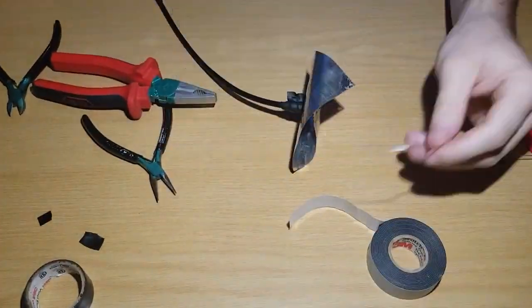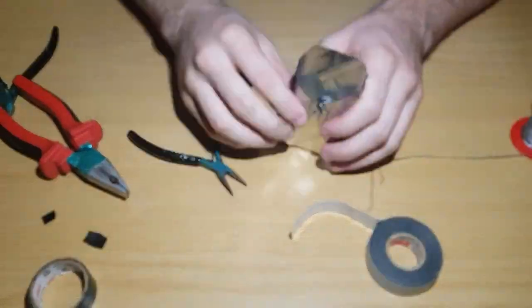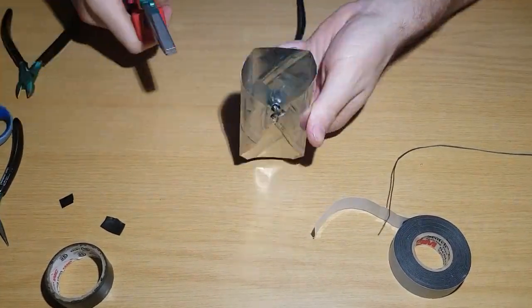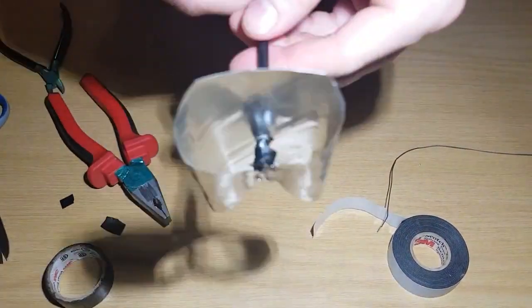The other leaf is then folded and soldered on the inner core. The antenna is then shaped using pliers. It is important to note that the leaves must not short, and the ground must not be touching the self-grounding plane. And that's how you build a self-grounded bowtie antenna.